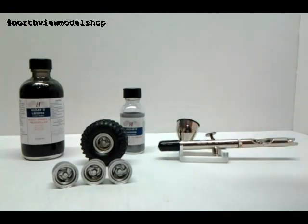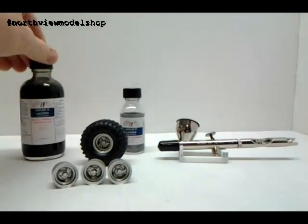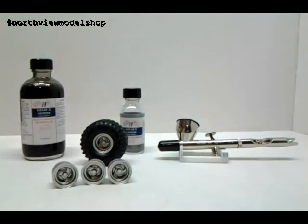This airbrush performed like a champ with this product. You get your airbrush loaded up and apply a real light coating — two coats allowing 30 minutes flash time in between. That got me a really nice, even finish. This is also a microfiller, so it filled in any little imperfections, though these parts were pretty clean so it wasn't a big deal.